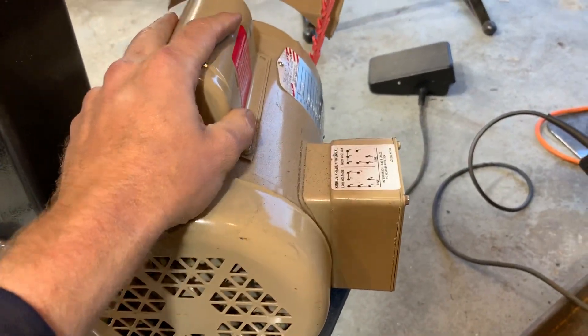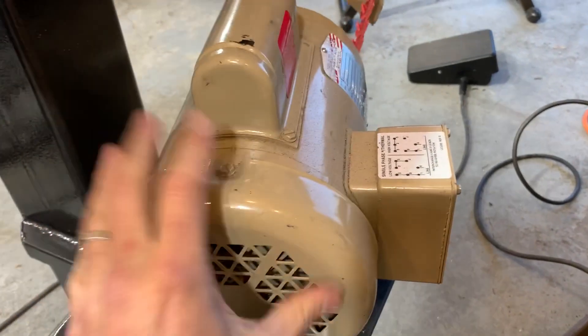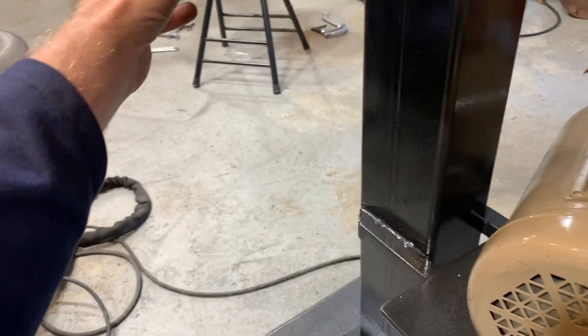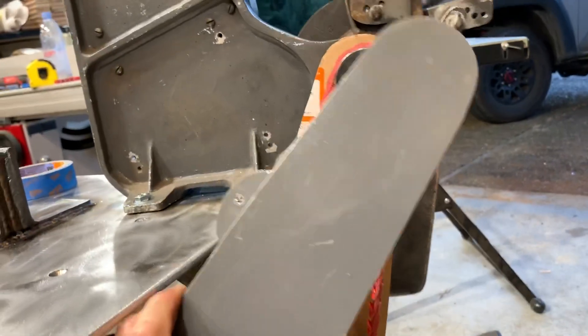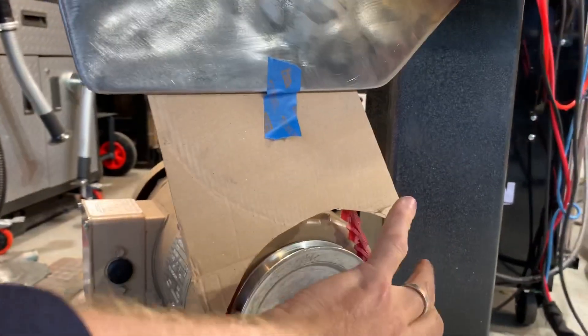Because of the way this is set up, I flipped the motor around. This motor is a TEFC — totally enclosed, fan-cooled motor. With the fan out here, grindings and metal droppings are not going to hurt this thing because the grinder exhaust is going to be back here. The belt grinder exhaust will be on that other side. I will try and contain it to some extent, but the belt guard goes here. So this will go on from this side. I welded up this piece of eighth-inch steel under here — this is really firm. There'll be a belt guard on this side and then attached to this side, it'll cover the bottom part.